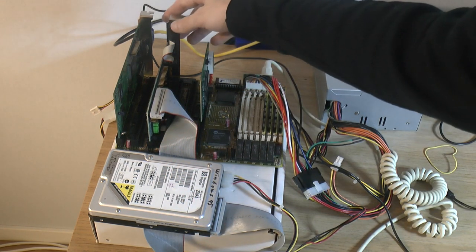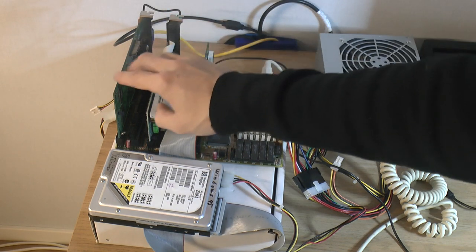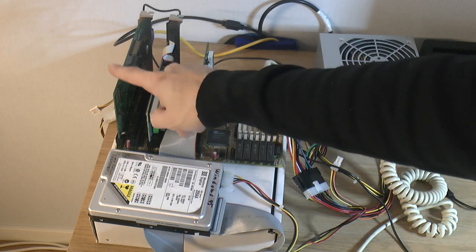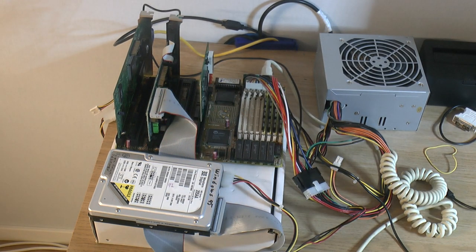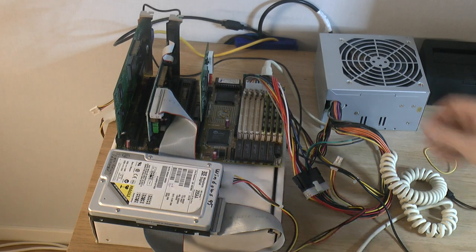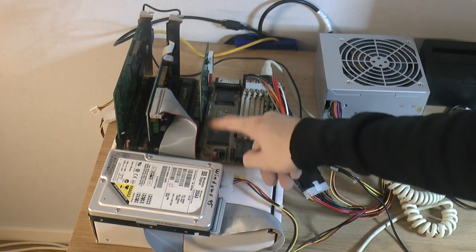So we have serial out here for the mouse. That's the basic we need. Pre-configured, pre-tested card. Always really want a good known card. And here we got a Cirrus Logic 5429, it says. So yeah, pretty decent card, but it's slow on ISA. But this system isn't fast enough anyway. Should fit well, and yeah, here's the CMOS battery mod, and the new caps and so on.